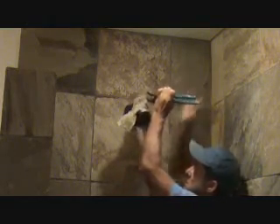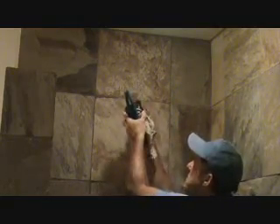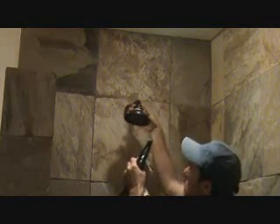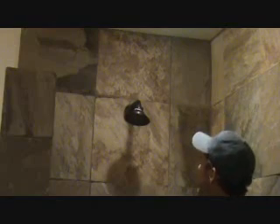That's all I'm going to do. Now I'm going to turn the shower head on and see what happens. If I get a little pin leak or something, I could put this back up there and tighten it just a hair more. The worst thing you could do is tighten this so tight that it cracks — I don't know what you're going to do to fix it then. So easy as you go: turn the water on, check it out before you tighten it again. Because if it's not leaking right now, I don't have to tighten it anymore.